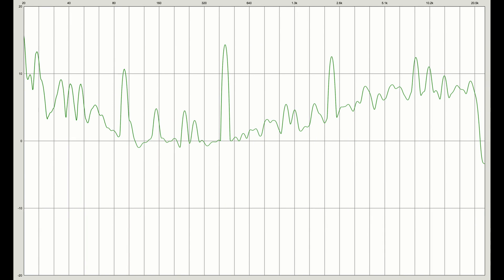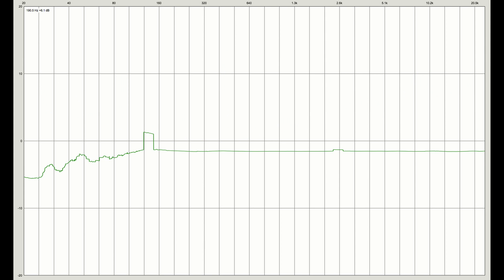What you can see here is a deconvolutional comparison between the two recordings. Essentially you can think of this like an EQ. The noise floor presented by the high gain G3 has a sharper tone to it as well as lower frequencies. Moving on to a comparison of an optimal level of voice, you can see there's very little difference in the spectrum apart from the low end.